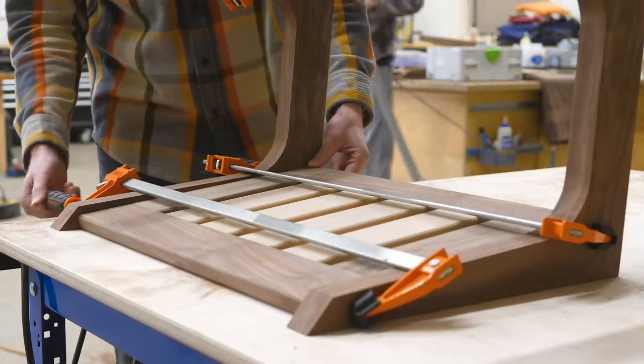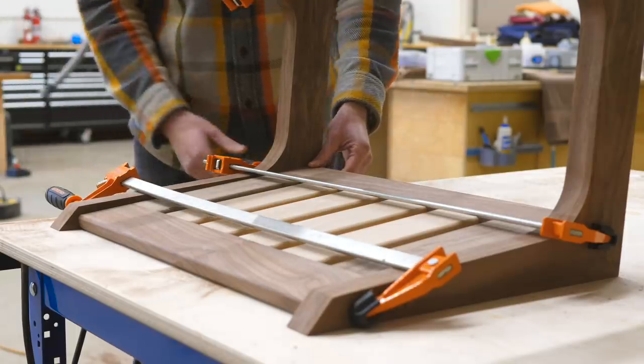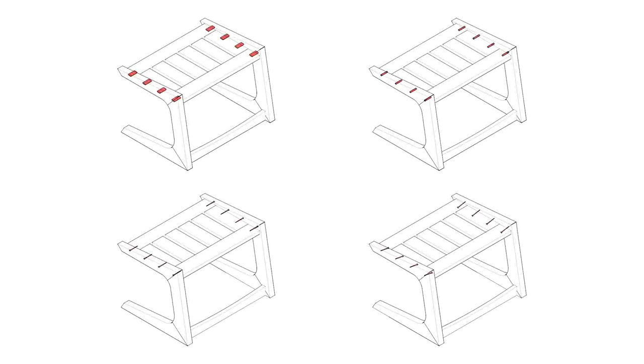At this point, all of our pieces are made and we can get to assembling. Now, where you put the panel in your ottoman is up to you. Basically, anywhere between the upper horizontal piece will work, but we want to have it angling slightly away from the chair. So the easiest way to tackle this would be with either pocket hole screws or regular screws.